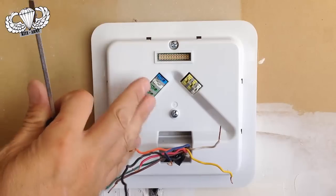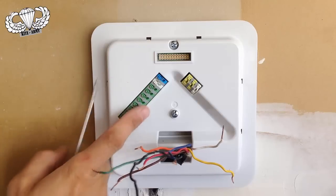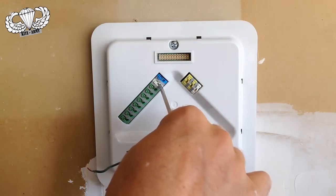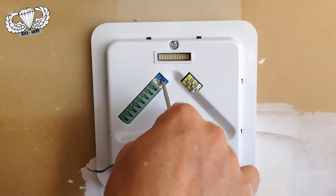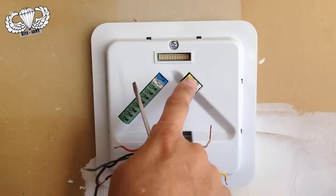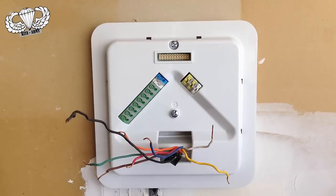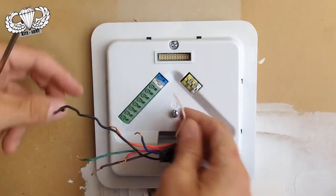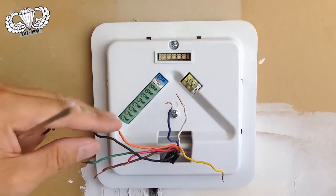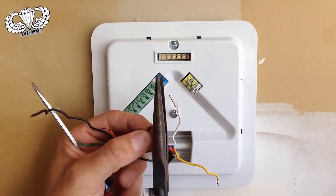I want to show you some of the electrical connections you might have to make to your Rachio. First of all, there are eight greens over here — each one of those is a zone. There's a common right here, and you have a blue which is a master pump controller — I didn't have that connection, you might not either. The two yellows are for sensors like a rain sensor, and you have another common white here. My gauge wire is really thick, and you can see when they came off the old controller they were kind of curved, so I took a pair of needle nose pliers and straightened them out.